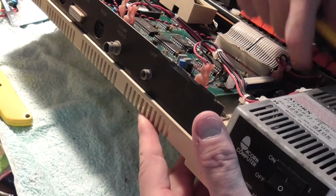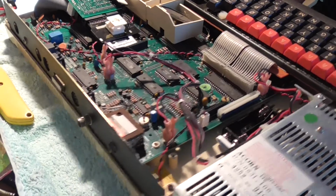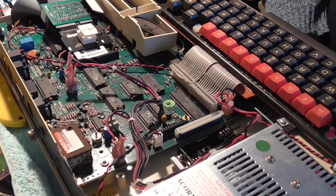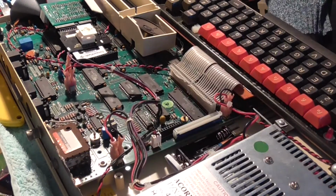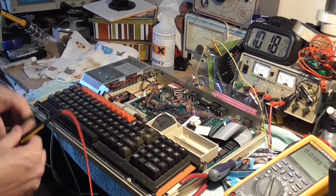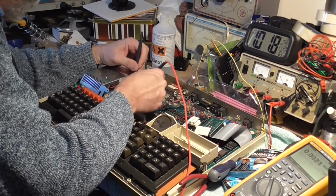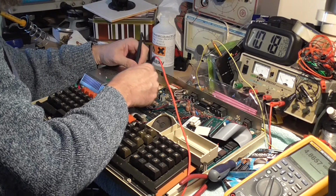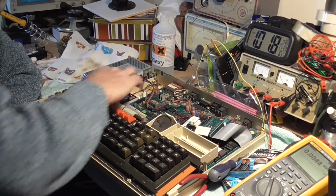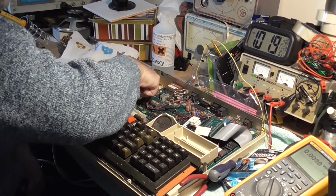That one. One more. That should be alright. Right, let's try that. Remove those two little bits of plastic. Alright, let's see if we've got voltage there now. Yep, now we have 4.8. That's better. Little pieces of plastic on the positive side in the battery compartment was just holding the battery off the terminal a little bit on two of them.